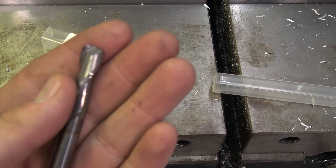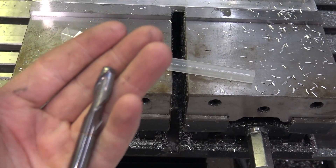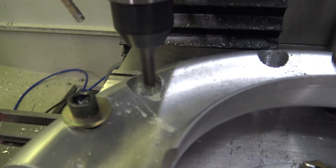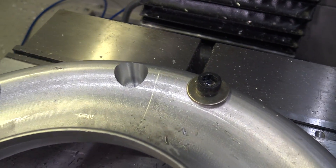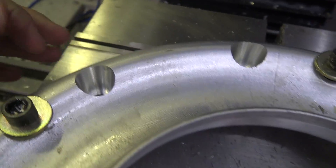As expected, we need to come back and clean this up. Instead of using a ball end mill, we've got some 90-thou bull mills from Lakeshore Carbide right here. Let's model that up in Fusion and use that. These are great for one main reason: because they don't come to a balled center, you don't have that surface footage problem like you do with a ball end mill. In this case, because it's just a radius in the corner, we can clean up that pocket closer to the square floor. Take a look at that — that was only a few-minute toolpath, and that's what you can do when you need to do it. That's awesome.